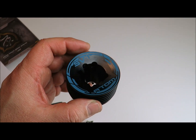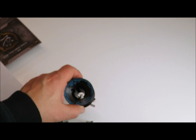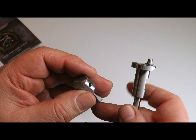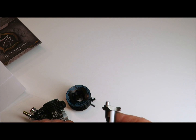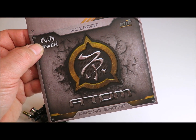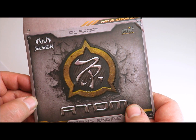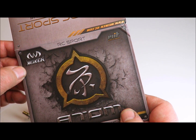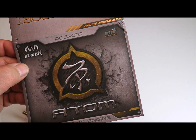This thing will actually surprise you for a Taiwan engine on its performance — it has a lot of timing in the crank and it's going to be a pretty good performer, I think. Only time will tell how the internals hold up under racing conditions, depending on how lean you run. Everything looks to be nicely done. I recommend adding head shims, and everything should hold up pretty good. I'm going to start doing more of these videos — if you have a request, let me know. If you know somebody that sells engines who can send me one for a review, I'll send it back new. It's winter here in Minnesota so no on-track testing in the near future. Thanks for watching — give me some feedback, go to rwmods.com.